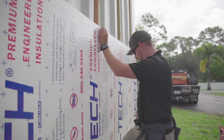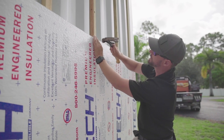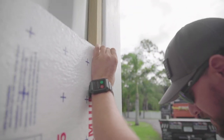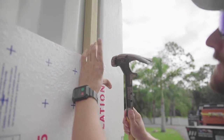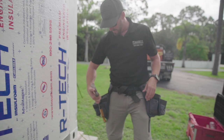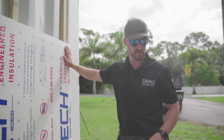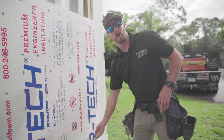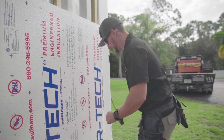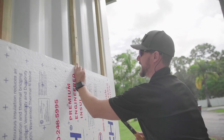Luckily, these are pretty lightweight. Just get a nail tacked into the center. I'm going to tack one more nail — that's just going to hold it in place. These are just kind of here to hold this insulation in place. When we grab our siding, we're again going to want to snap lines. You just got to put a couple in to kind of hold it in place, and sometimes you can just go in a straight line down and tack in a couple.